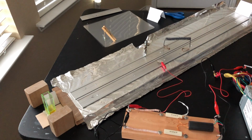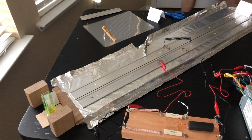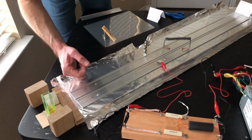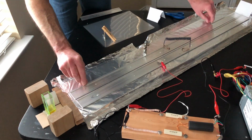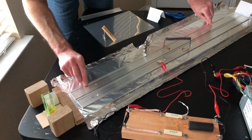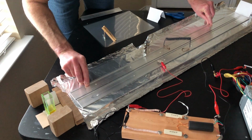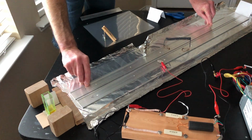You won't get a laser output. You may get a discharge or some sparks between the electrodes, but you won't get a laser output. It's not just a bunch of fancy sparks between two rails and then you get a laser. It's not that simple. Things have to be done right. Unless the discharge is very, very fast, this won't work at all. So I messed up my electrodes. I'm going to do some adjusting on them again here and see if I can get the channel just right.